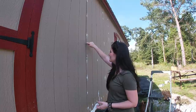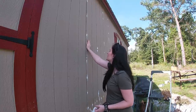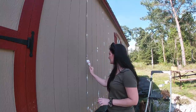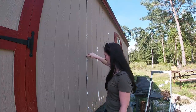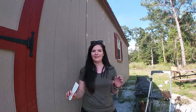Can you see that gap right here? This is where two pieces come together, and while there were all those nail holes that I covered, those are not holding anything in. That is way too much play because water can definitely get between there and get into the house. So I'm going to go see if we have any nails and go ahead and secure this now.